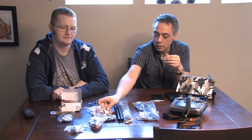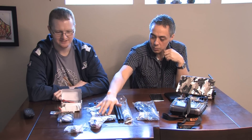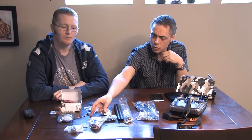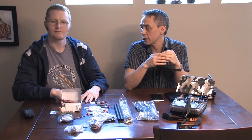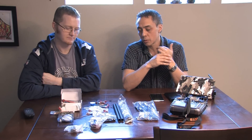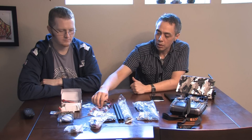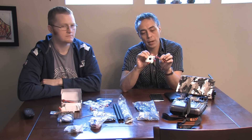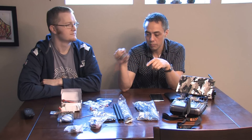You'll want to grab Droid Planner or ArduPilot — the freeware UI is pretty slick. That's the GPS we're going to use; it's a 10 Hz unit, which is a slower one, but sufficient for what we're doing. It's also a cheap upgrade path — you just plug in a new GPS. We also have a series of adapters to make it easy to plug everything in, and a power distribution board, which is the central core where all power is distributed from the battery, supporting four motors and powering other devices like the Arduino.